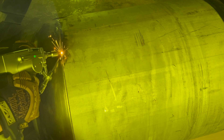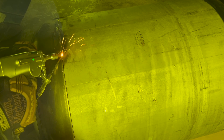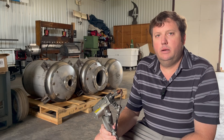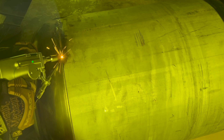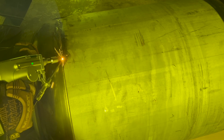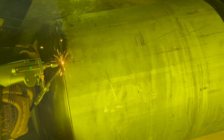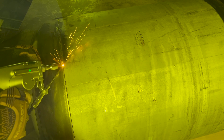We all know the majority of welding is never really just butt welding or lap welding — that's where this has some learning curves. I really think if you're a skilled MIG welder this is going to be easy to pick up, because some techniques like using a J-motion to fill gaps are the same. You can fill gaps probably as big as a quarter inch with this, but once you mold your technique to it, this technology has so much more capability than any other welding process.